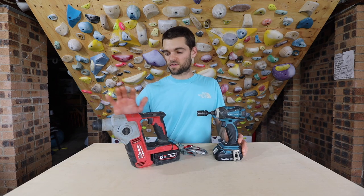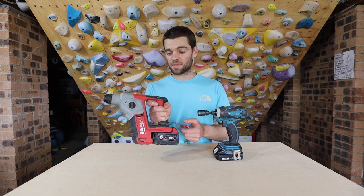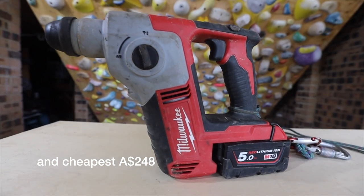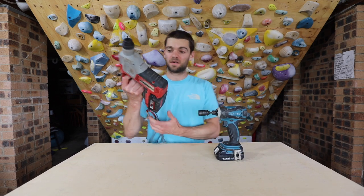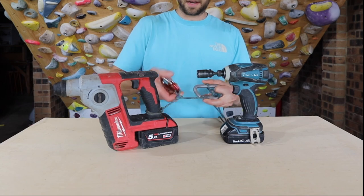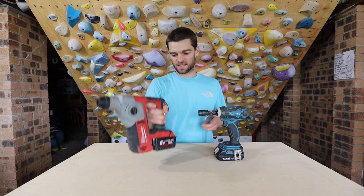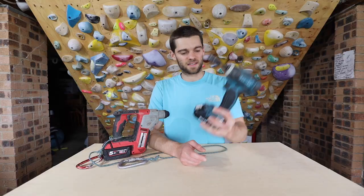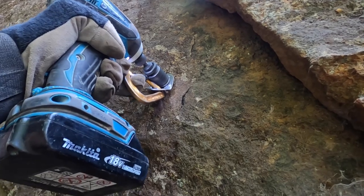These are the drills that I use. I've got my Milwaukee 18 volt hammer drill and then I've got my Makita 18 volt impact driver. The Milwaukee is the lightest in the hammer drill range and it 100% does the job. I've got some friends that have got the big higher powered ones, but when you're out on the roof going all day long, you don't need that weight behind it. I've also got it set up on a string around the handle, comes to a little Alpine butterfly and then attaches onto me — always make sure you've got full reach with your sling length. This Makita is what I use to put in my concrete screws, my positioners. Just that small little 1.2 amp hour battery goes all day. They just whip in real quick, come out real quick — it's a neat system and the concrete screws feel absolutely bomber.